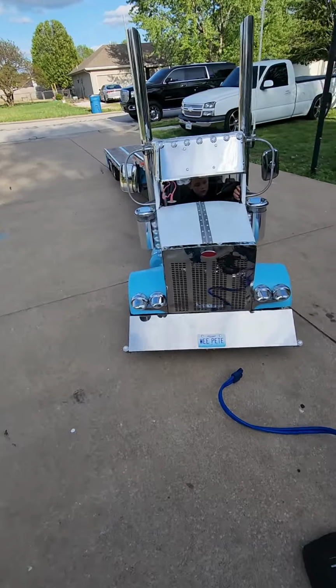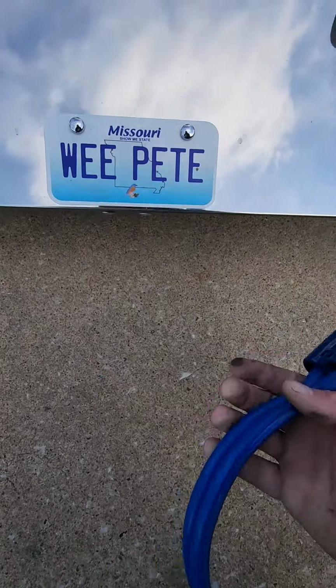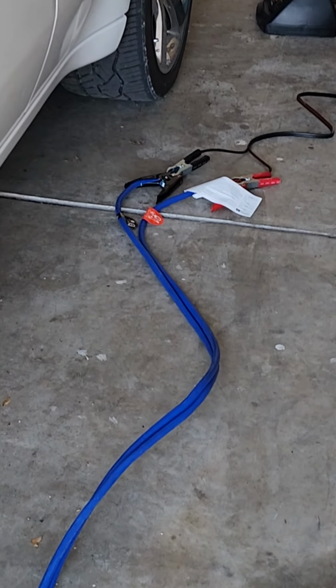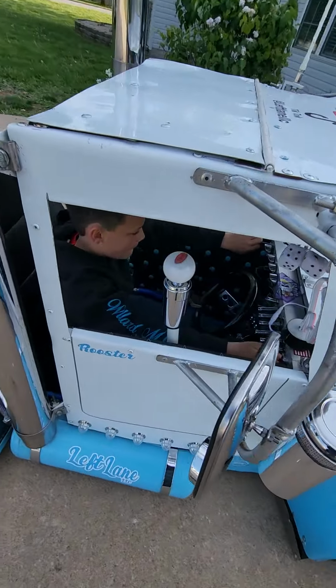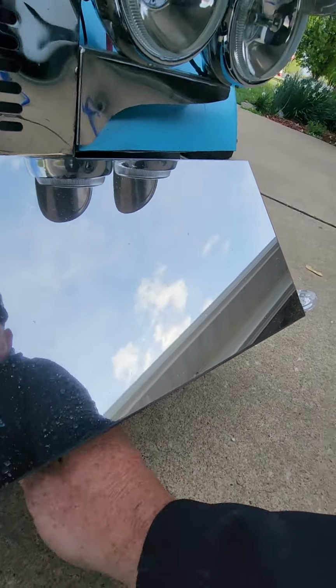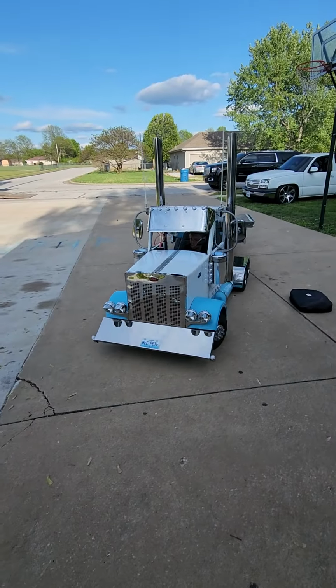So we'll actually do this part of the video. The battery is dead right now. I don't have enough to turn it over. It's only 11.4 volts. But I can show you. There's the plug for this guy. So we plug this in and then we'll be able to jump it. The cables, you can hook up to another vehicle or my truck so you can run off my batteries and play the stereo, but otherwise we just throw it on a charger, hook up the clamps. Fire in the hole. There it is. And then we just come over here. Push down here.